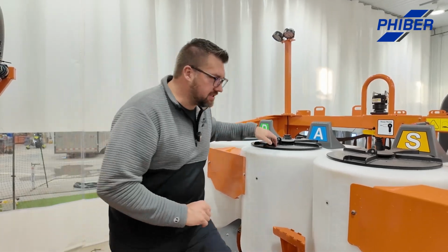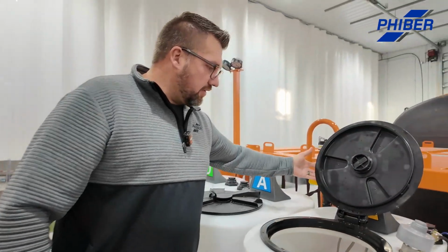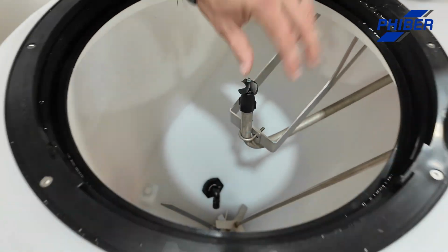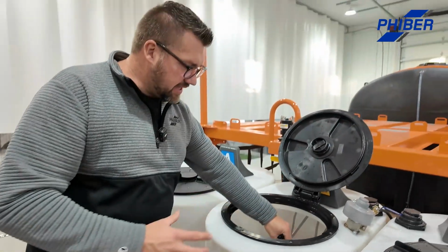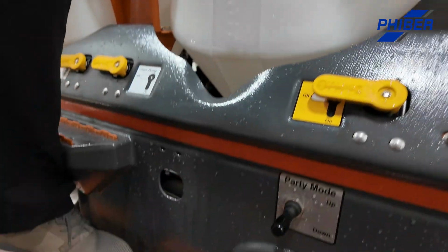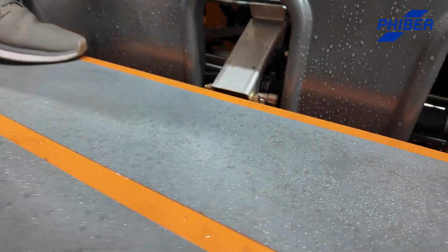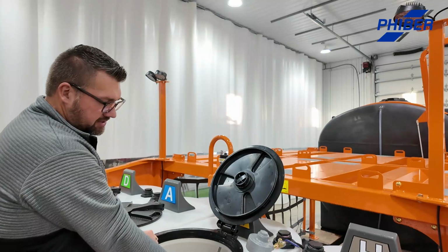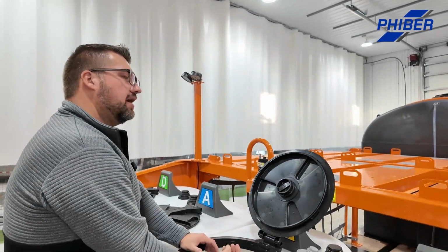Now, they all process jugs the same way. First of all, they have a rinse nozzle inside. You put your jug on this little stem, and there's a foot pedal down below. This foot pedal does 2 things. It's a 2-stage foot pedal. You push it part way down, and there's an air line that comes through this rinse tube right up into this rinse nozzle, and it'll inject air into that jug.